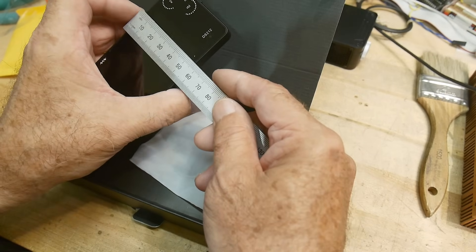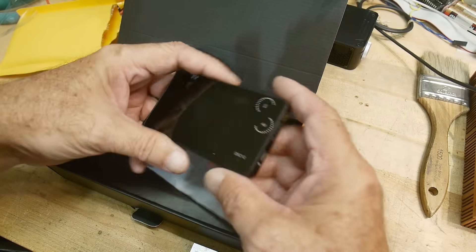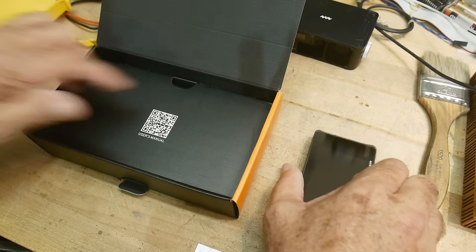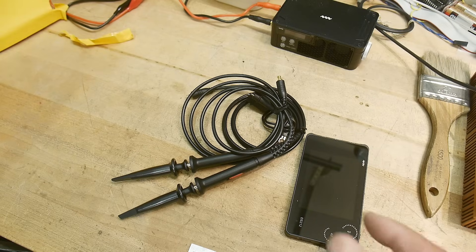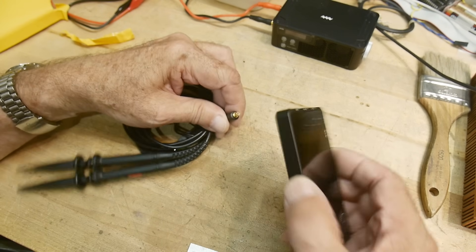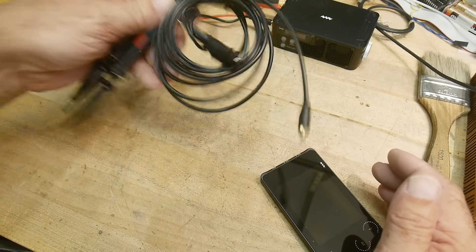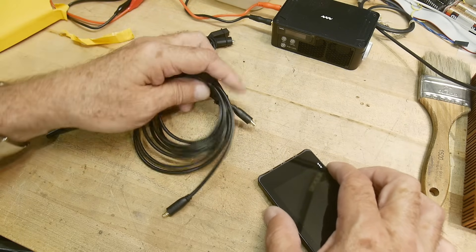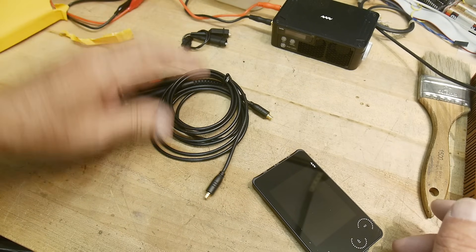It is 100 millimeters by 55 millimeters by 9 millimeters. It's metal - it feels very quality, with a nice shiny front. Good first impression, well done. Now it comes with two scope probes, and these scope probes are better than the others I've been receiving. They use these little connectors - not SMB, not SMC, not any of those SM things - they're different, and they plug right in. All the other probes I've gotten from companies are BNC probes with an adapter, which just adds a bunch of length and makes it prone to killing your device. These are actually made for this product - they have molded-in connectors on the scope probe. Well done again.